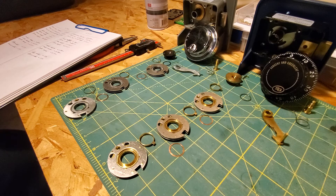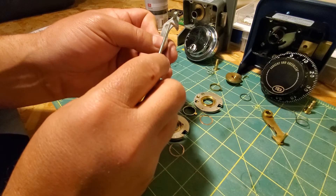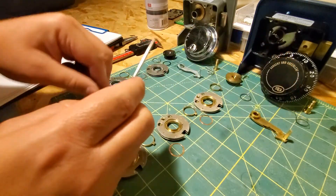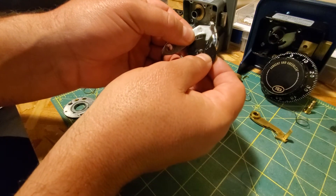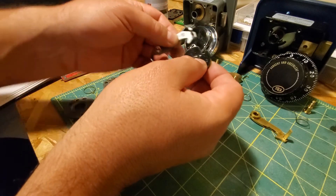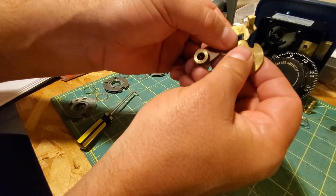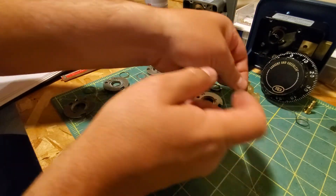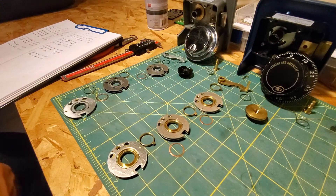Something else I noticed is that the nose on the 6741 is longer than the nose on the 6730. I've noticed when everything's put together that the nose on the 6741 does fit deeper into the drive cam. And with that, even though it's just a little bit, it makes a big difference in manipulation — you can feel those contact points quite a bit easier than on the 6730, where it just barely touches the edges of those contact points. So I have a much tougher time manipulating the 6730 versus the 6741, and I have my longest Group 2 manipulation times in the 6730.